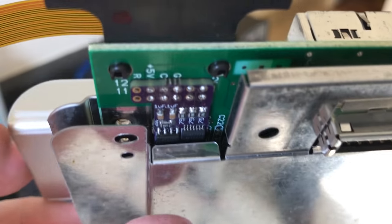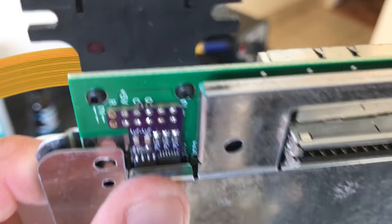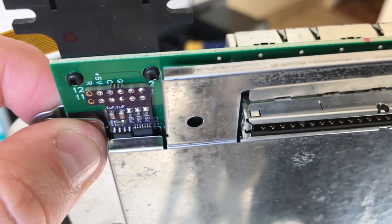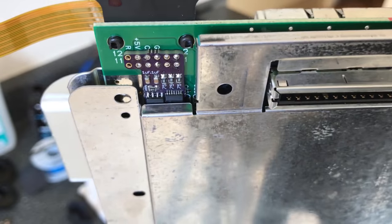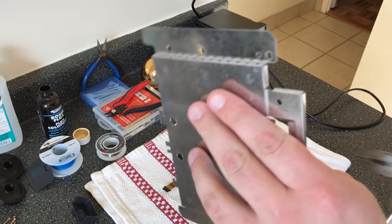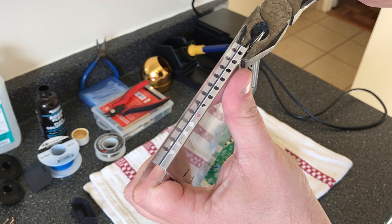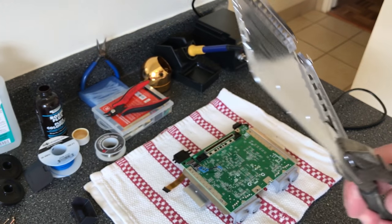As you might have noticed, this board interferes directly where the bottom shield comes on. So you could leave it on that. That's actually non-conductive, leaving it on the top of the chips, but then you'll have that space. So what you need to do is bend this tab down. Now, I'm sure there's a more elegant way to do this. If Michael from Badass Consoles or Zach Boltar was here, they'd probably just cry and laugh at me, but I like solutions that work. This is my N64. I don't do customer installs. I just work on my own stuff, because to be honest, I'm not good enough.